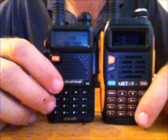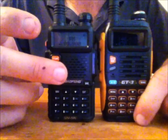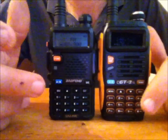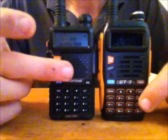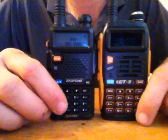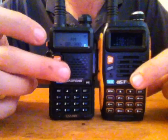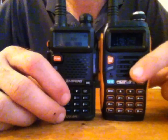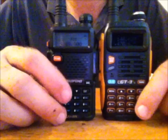The new hardware also fixed the receiver sensitivity. With the old UV5R, sometimes if you were close to a station it would still break up like you were far away — it was actually the sensitivity in that radio. The squelch on the old UV5R, even if you set it from number one to number ten, it would still go off in your pocket or in the truck. They fixed that in this model — when I drive in those areas with this new radio, it doesn't do that anymore. The higher you set the squelch number, the higher the threshold.